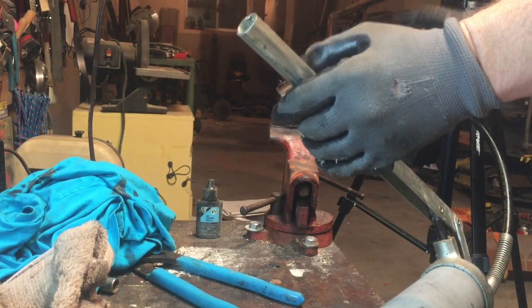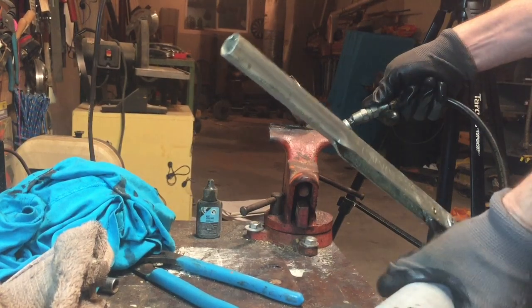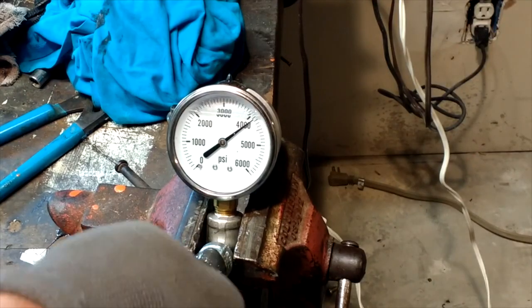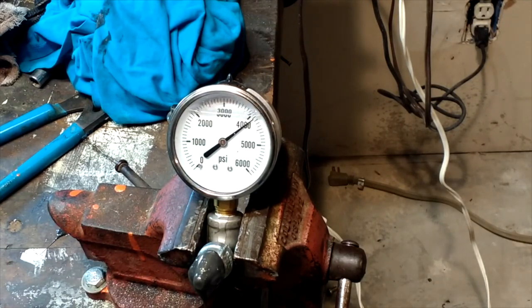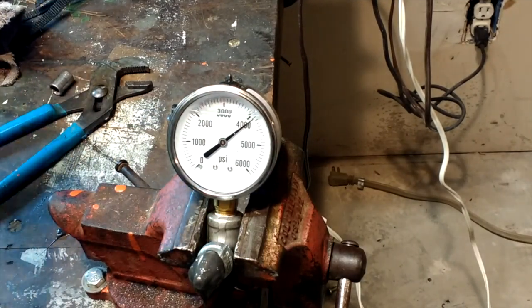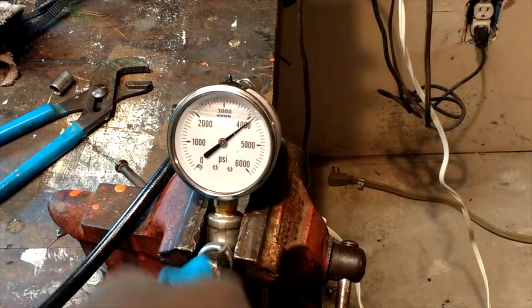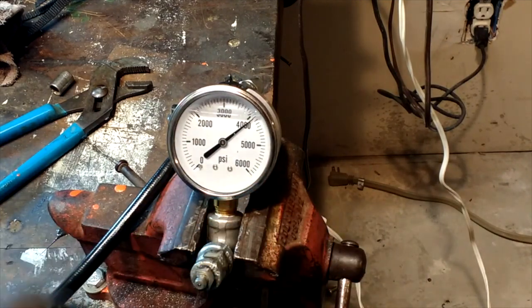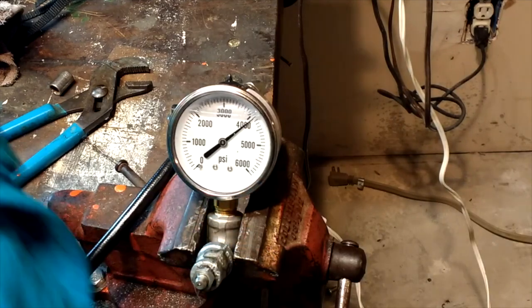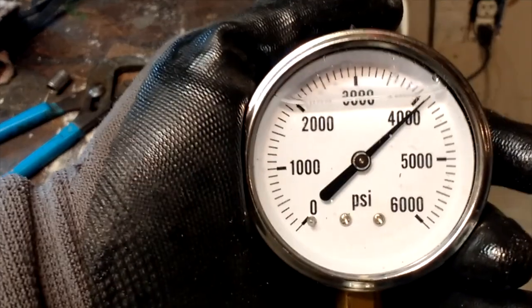That's a lot of pressure just from an average grease gun. Now this is going to squirt out here when I take this off, I have a feeling — and there it goes. Now we used to have a lot of bearings that didn't take grease, and usually we had to replace them because you can't have any downtime in a factory, and they did not want to have a bearing getting hogged out. Let me wipe its nose, get all that grease off there, and I'll show you where we're at — right about there. That's a lot of pressure.